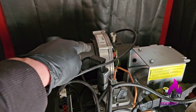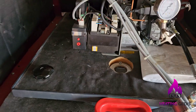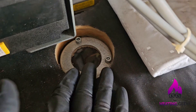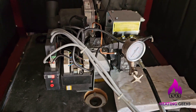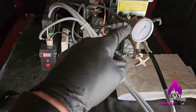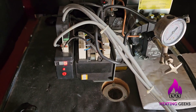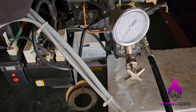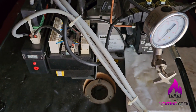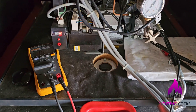Let's see if we get a solid red light on this one. The good news is we know it's not sending unburnt oil in there, so that's good. I'm going to get my multimeter set up to test the solenoids. I know it lights stage one — this solenoid here — I've just got to work out what's what on it.